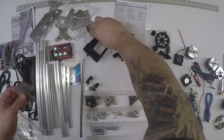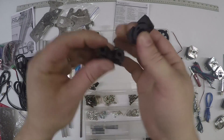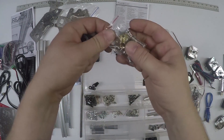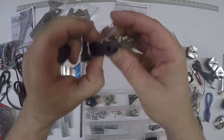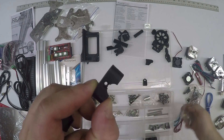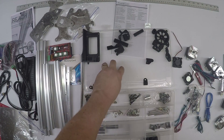That should cover the hot end, spool holder, and extruder. This is your Z nut clamp. This brass fitting goes in like that and the holes are specific. You can either run bolts going upward or you can run bolts going downward, depending on if you want the gantry to slip up off the Z screw.